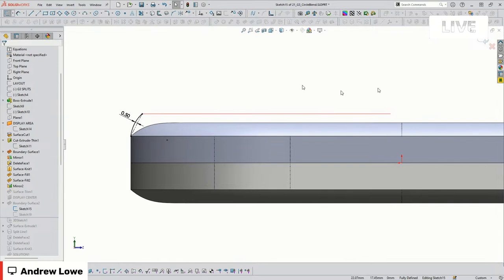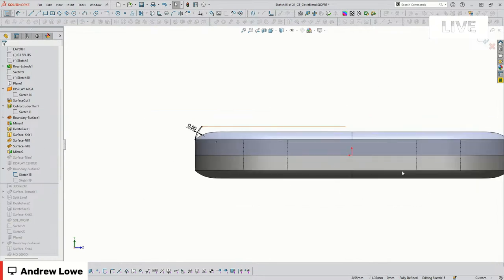And then as the design evolves and it's ready for a final master model design, before having some engineering input to integrate the display, the PCB, and the fastening features, whether it be snaps or screws, lips and grooves, I want to make sure I have that really refined exterior geometry. That's where I'll take the time to build a really robust surface model of the product.